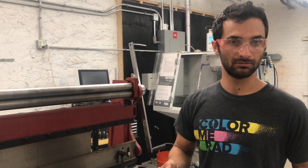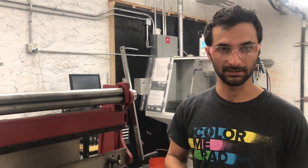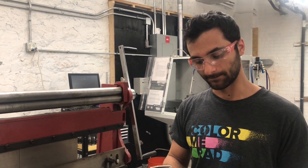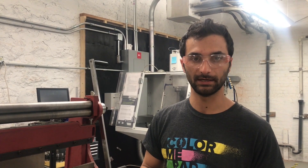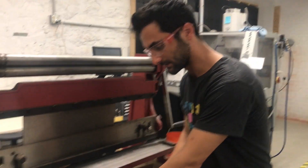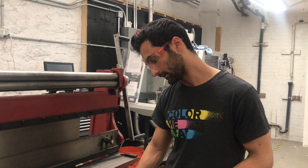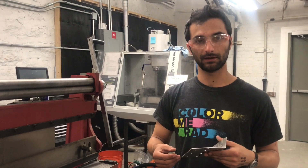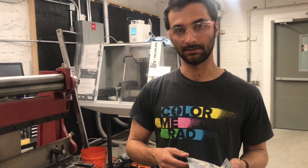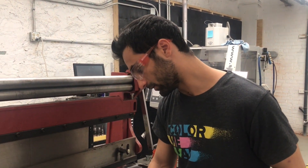What you can do is just test it. If it seems like you're going to have to be pushing a whole lot, then don't do that. Anything hardened, you're not going to be cutting. If it's giving a bunch of resistance, you're going to damage the blades if you try to cut too much or apply too much force — the blades will try to slide around and it will damage the tool. So preferably thinner materials. If you're trying to cut something thicker, then you're going to use some kind of saw or a water jet — another tool will do a better job of cutting it than this one. This is for pretty thin sheet metal.